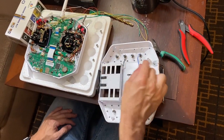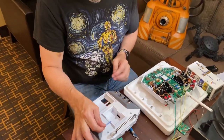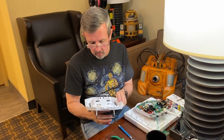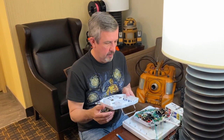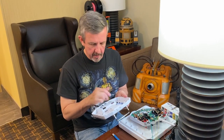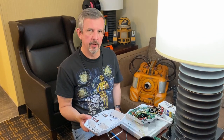Depending on how many colors of wire you have, you may want to go ahead and tape these two together with a piece of tape so you know they go to the same switch. As far as switch numbering, don't worry about that. You can adjust that in the software once you get all of them installed onto the board. We'll go through programming of the board after that. Okay, I'll go ahead and get the rest of these 8 hooked up, and then we'll get the remote buttoned up, and then we'll look at installing onto the board. Okay, see you in a bit.